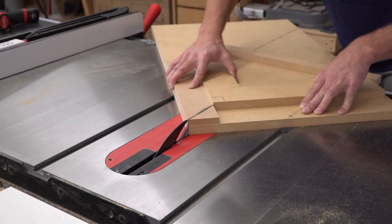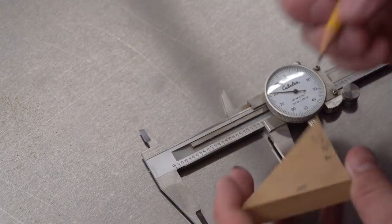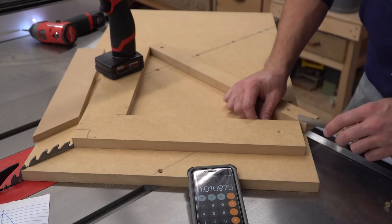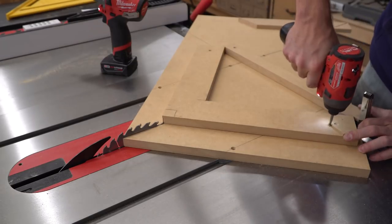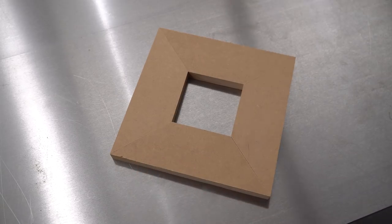I made a test piece with a perfect 90 degree corner, cut that corner off, and carefully labeled all the important components. I measured both sides of my new triangle — that would tell me exactly how far away from perfect my fence was. I'm not going to pretend I can explain what's going on in this step because math and numbers just aren't friends of mine. Truth be told, I actually struggled with this step quite a bit, but in the end I did come out with a more accurate miter fence. Just make sure you check out William's video in the description — he does a much better job explaining it. In essence, William's formula tells you precisely how far you need to move your fence for it to be perfect. After a little struggling I got mine exactly right. I made a little test frame to see how well it worked, and those miter joints are far superior to anything I've been able to achieve up until now.